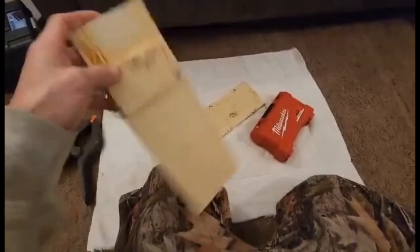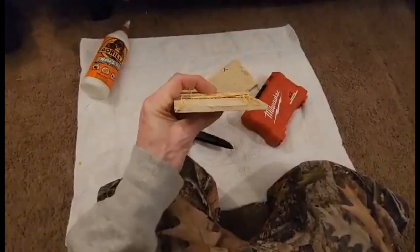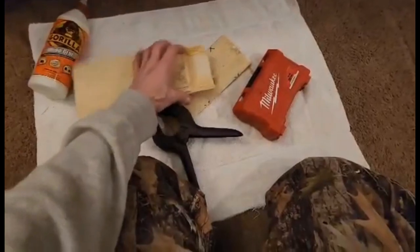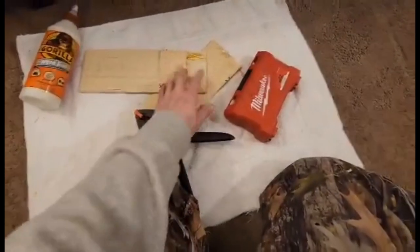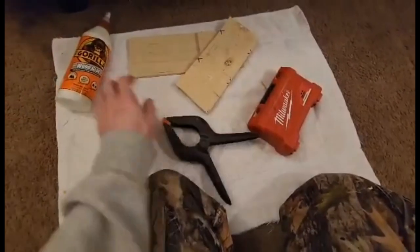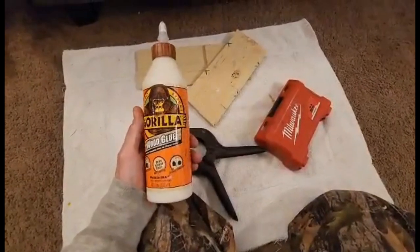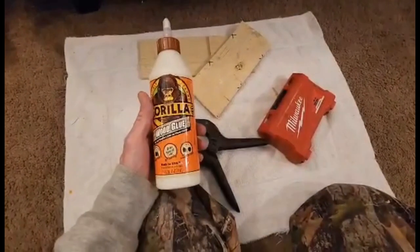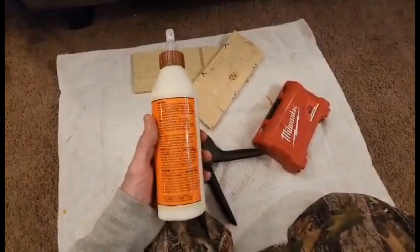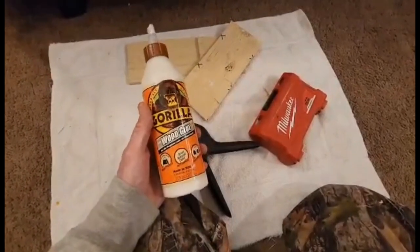It's a little tacky. With just one clamp right in the middle, you can see it's stuck really good in the center, but with only one clamp you're not gonna get full clamping across the whole piece. Overall though, I've glued two-by-fours, two-by-sixes — everything with this stuff and it will not come apart once it dries. It says 20 to 30 minutes to clamp, but it also says it fully cures at around the 24-hour mark, so leave it clamped as long as you can.